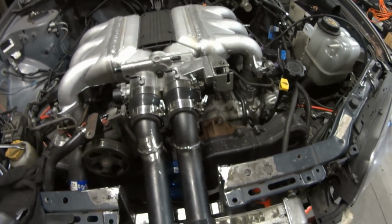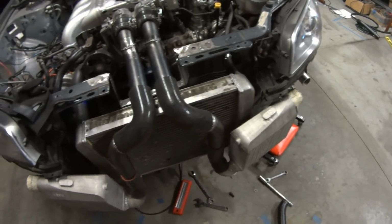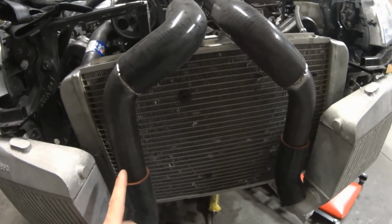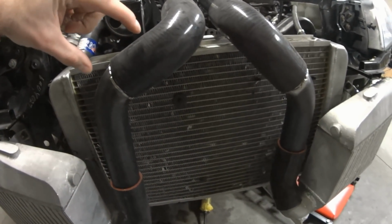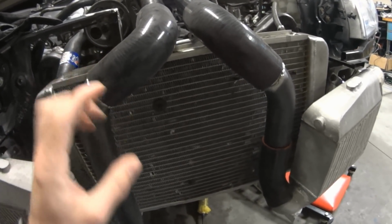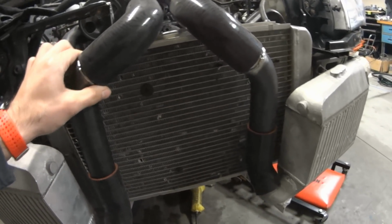This one took a little more cleaning up the weld than the other one, but then those just go straight here and they stop. And so I have these 90 degree couplers on each side going down there. And then this side essentially was the start of a 180. And so I just cut it right there and then used the short straight piece that was left over from making each one of those on each side to have a nice straight, perfectly round piece to clamp to on each side. And I've given them the pressure test, and they seem to be solid.